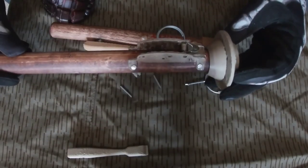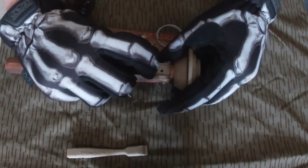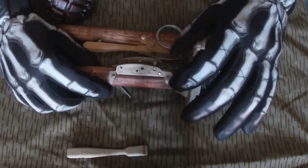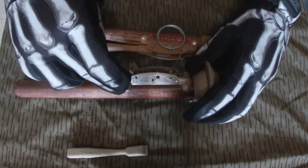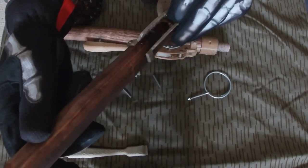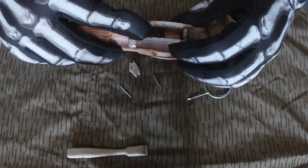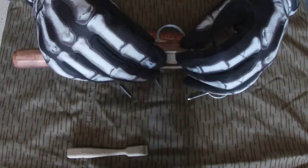Now that I have disassembled this one, we can see the parts that require fitting. We have to drill a hole through this part to the depth that the primer will sit initially. Then we need to drill the base that the center part sits in, pin the center part between the two flanges, and I used a small drill bit to pre-drill these nails and hammered them in at an angle that will not introduce them to the center fuse. I've drilled a small hole that allows the leg of the M228 spring to sit further down, to make assembly of this part easier.